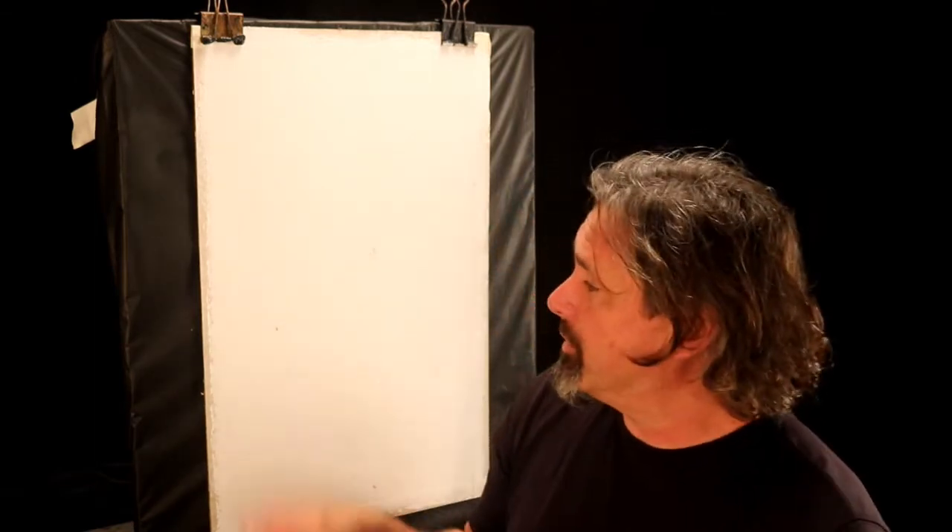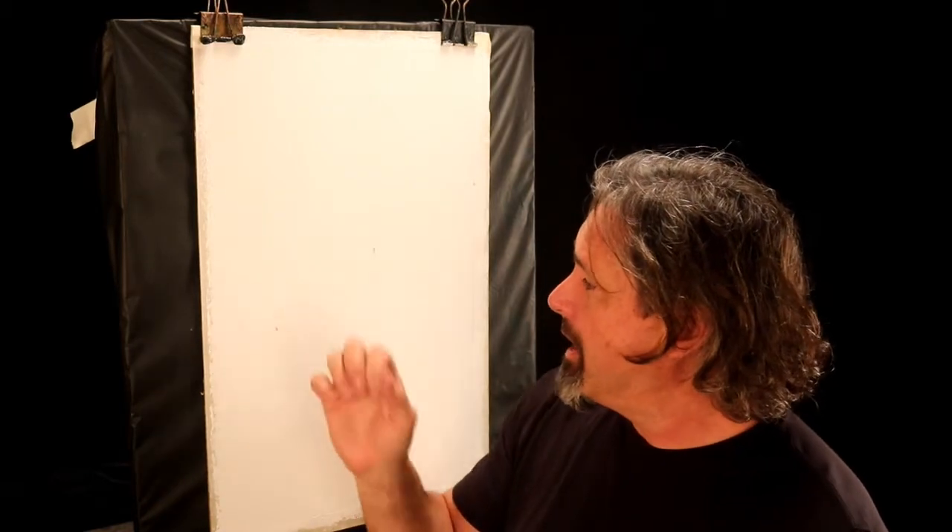Let's start out with the baby steps, so the basics. First thing I did was prime the surface with a base coat — it's a lime-compatible base coat, meaning lime plaster can sometimes have an adverse reaction to certain paints. If you put a primer from your local store on, roll it on, and then put the lime plaster on, the pH content is so hot that what happens is delamination issues.